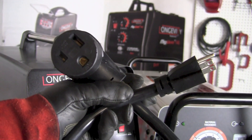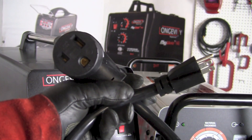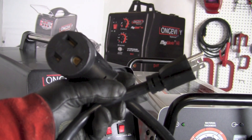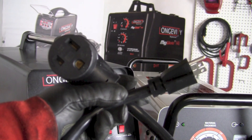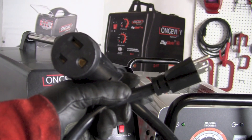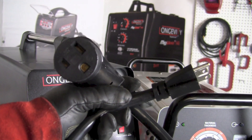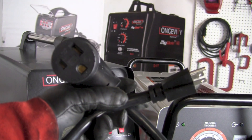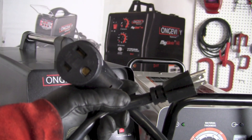Another important comparison is input voltage: the Longevity TIG Weld 200SX is capable of operating in 110-volt mode, whereas the Easy TIG 165i from Hobart is only a 220 or 230-volt machine. It will not operate on conventional 110-volt power, so the 200SX's dual-voltage capability is a great versatility advantage for its users.